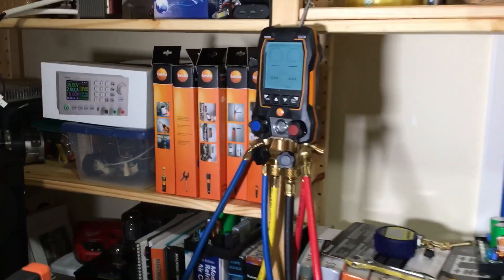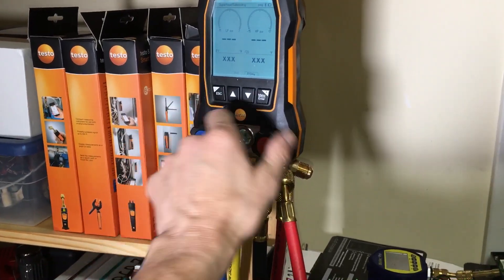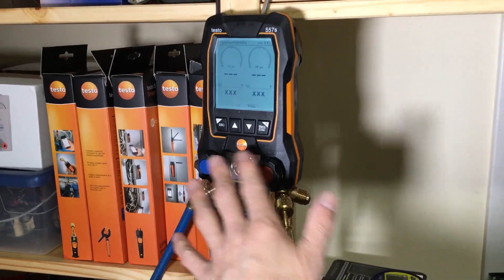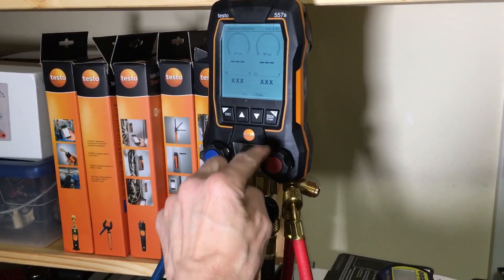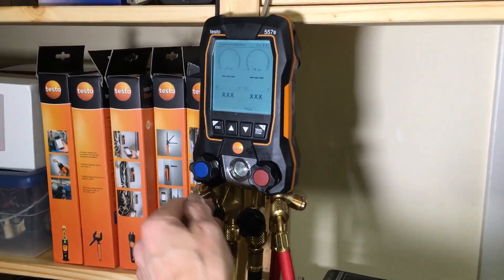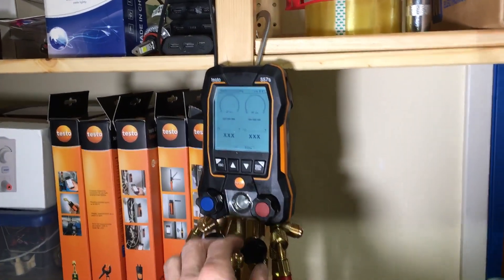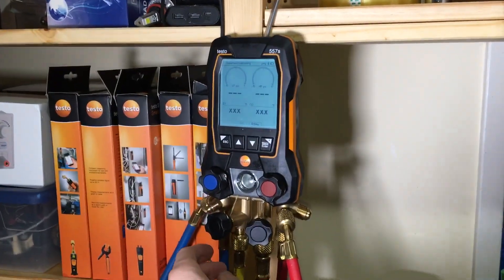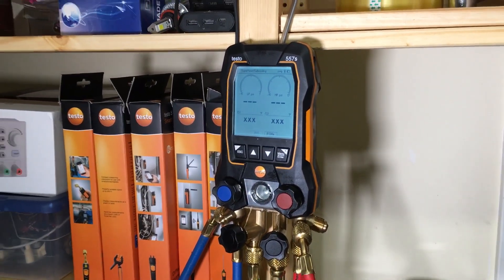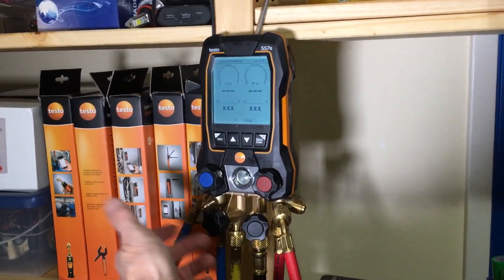So let me kill off the vacuum. I'm going to close off the hoses to make sure that just the gauge manifold itself can hold on the first day. After that I'll go to the hoses. Because I'm bringing this out in the field, every day I've been performing different tests on this to see if it's ready and won't give false results. I don't bring new tools out and then find out they're faulty once you're up on the roof — that's kind of a bummer.